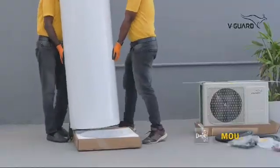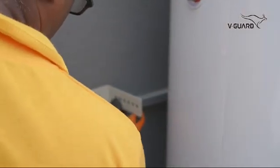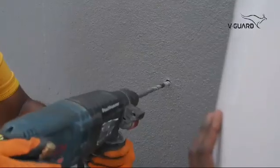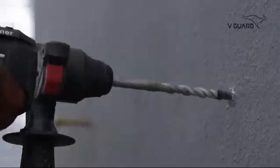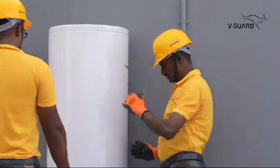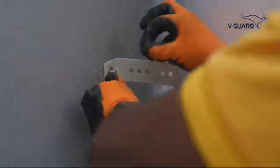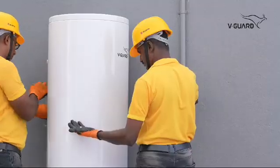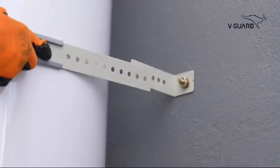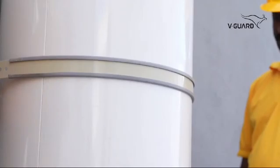Select an appropriate location and place the storage tank on a stable platform. Identify spots for the support frame and ensure the position using a water level. Drill holes and insert the expansion bolts. Position the storage tank, place the support frame into the bolts, and tighten them in place. Then place the water tank fixing strap and use the provided nuts and bolts to tighten it — this will prevent unnecessary movements.